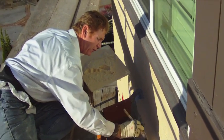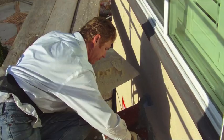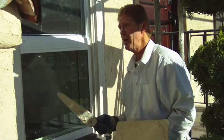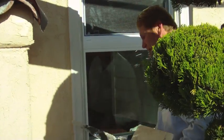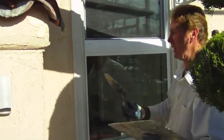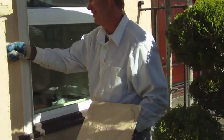I'm just making sure the grout area is protected since it's been changed so many times — there are lots of imperfections on this job. Also, the fellows who did these columns never got into the back, I guess because they didn't know how to. You can go up this way or that way, and we don't have a trowel to go inside, so we use a pipe trowel to get in there and work way inside.